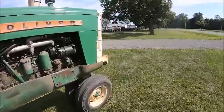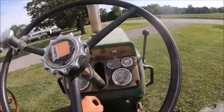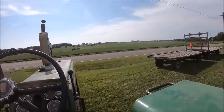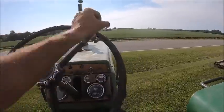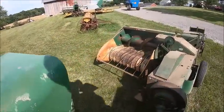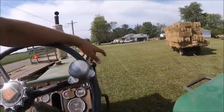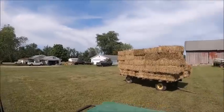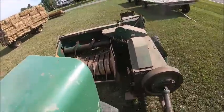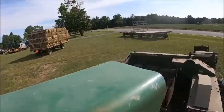it's making bales. And obviously the more straw you run through it, the more shined up it's going to get, the easier it's going to bale. There's some decent sized windrows out there, and there's times where I've got the auger pushed all the way up against the top stop, and I'm pushing straw with the pickup because it can't take it fast enough, and I don't even slow down. I just let her eat. Haven't broke a shear bolt yet,